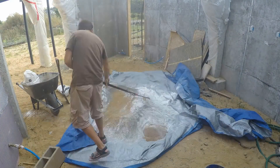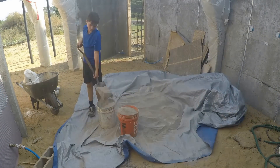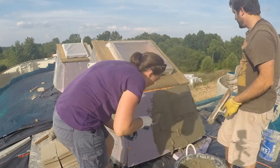To save some money, we're mixing our own stucco: five buckets of sand, 94 pounds of cement, and 17 pounds of lime, mixed on a tarp. Then we put this mix into buckets and take it up onto the roof of the garage, where we mix it up using a drill mixer and slap it onto the lath.